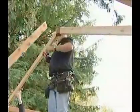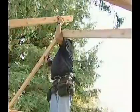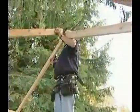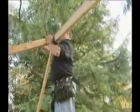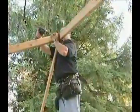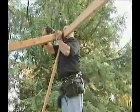As you can see, another core block is the key to proper fit of the rafters. An improperly cut block will result in the components not having a proper fit. Notice that the design of the structural components for the roof are similar to that of the framing that supports the decking. Having components cut to proper angles is essential to a successful result. You will need an assistant to complete this phase.